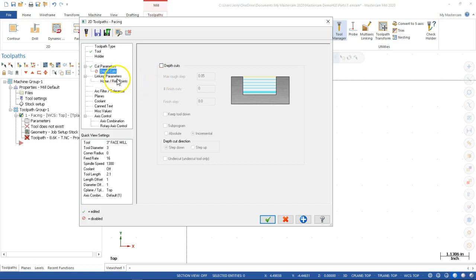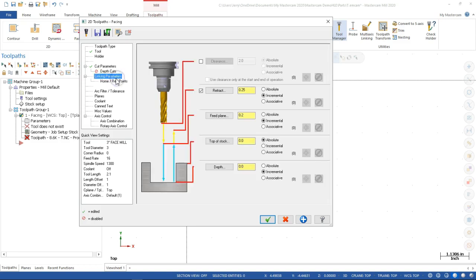So then I can set those depths, and I know that I have to remove somewhere around a 1/4 of an inch or so. Then we can take it in a couple of passes with the depth of cuts. All right, so for our next couple of programs, we're going to stay with the absolutes. And 1/4 of an inch. So on this one, I'm not worried too much. I'm going to stay with my standards.